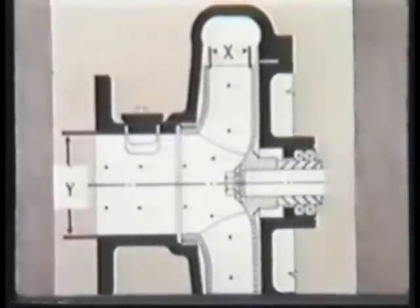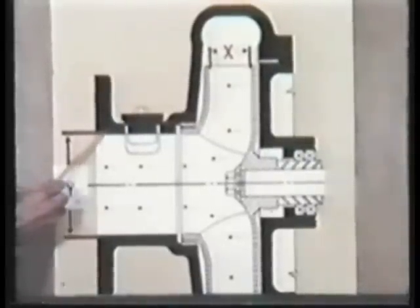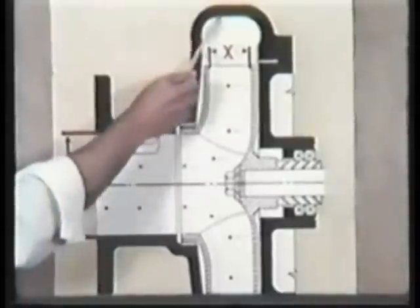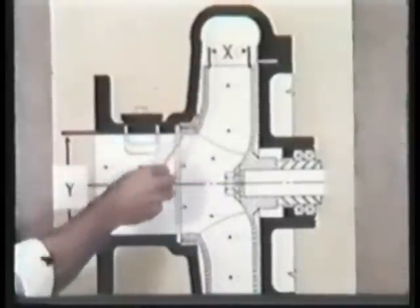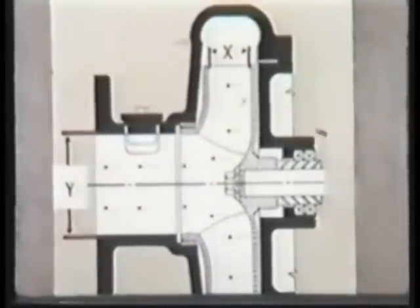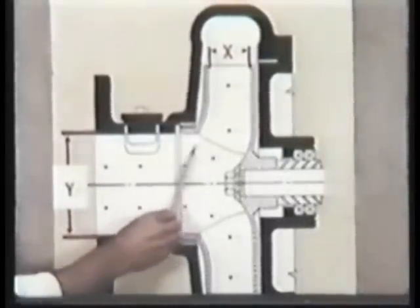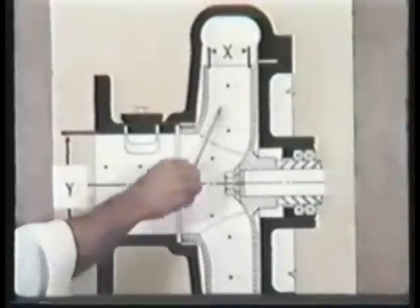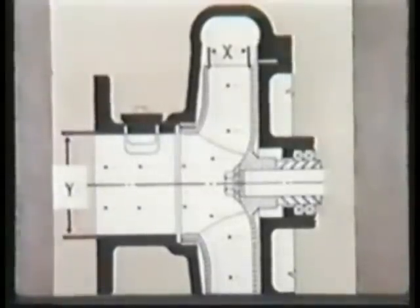It was the first time they had ever seen a pump with such a remarkable combination of power and delicacy. Let's get an understanding of how this amazing pump works. But first, here is a cross-section of a conventional type pump. The heavy black area represents the casing. The impeller is indicated by the diagonal lines. In this conventional centrifugal pump, the entire flow must go through the restricted impeller eye area, then make an abrupt change of direction and flow out the discharge port. This presents serious problems.